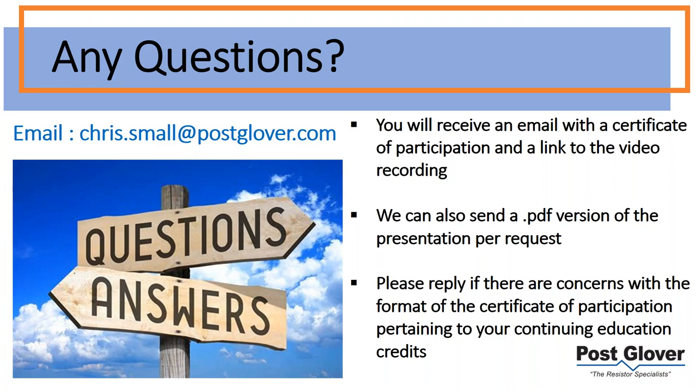Because of that, just to follow up with what I just said, if you hook them up delta, then you don't have to worry about the capacitive charge current. That's definitely an option for you. If you wanted to keep your surge arrestors, you'd just hook them up delta instead of Y. That way you wouldn't have that additional capacitance attached to the system ground.